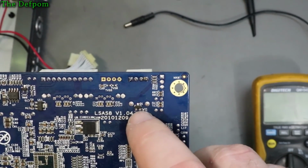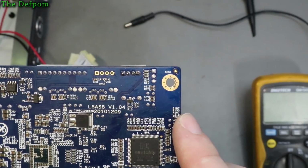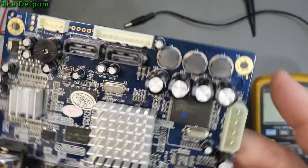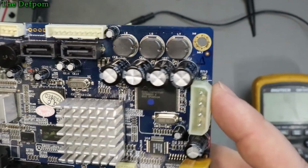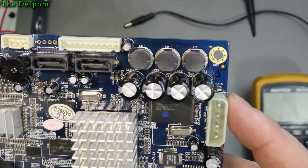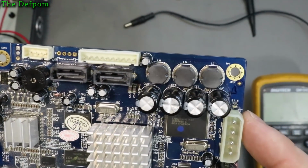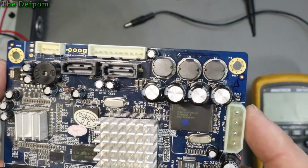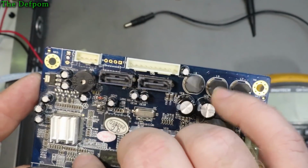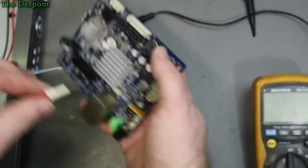Here's a transistor just here. But I'm not going to go digging through that much detail. I'm just trying to figure out those things. I think it's pretty dead. I was hoping to find some kind of simple issue like a dead power supply or something like that, but I don't appear to have been that lucky. Don't see any fuses anywhere. There's another crystal there. That's marked X3. It's an oscillator circuit. I should check that too. Just in case.